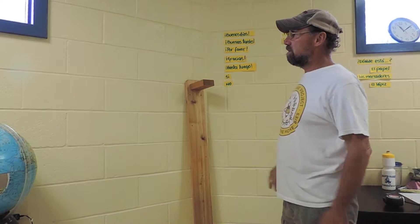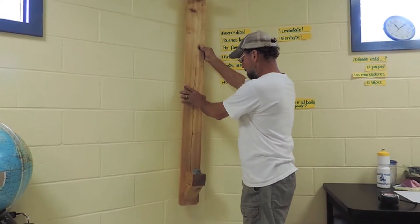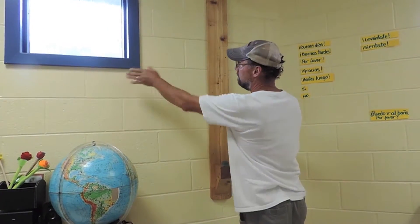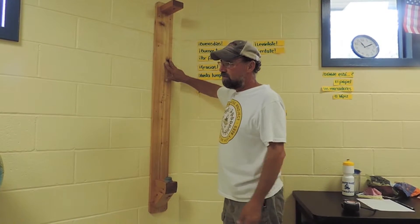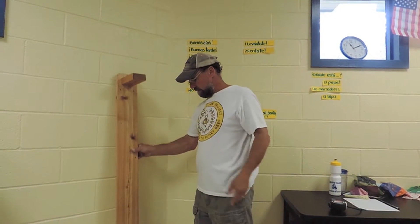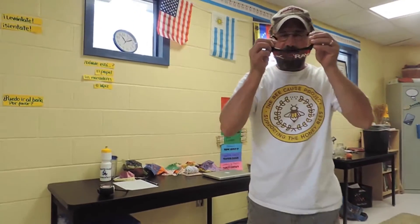Some considerations are what kind of wall you're going through — whether it's a block wall or a stud wall — and what might be in the way. Symmetry comes into play, as well as the surroundings, which way it's going to open, how it's going to swing and pivot. If we put it here it wouldn't open fully; if we put it in the middle it's going to cover the window part of the time. We don't know if this is a solid or hollow wall or if there's rebar, but these inspection tools will allow you to see through the wall so you know if you're going to drill into anything.